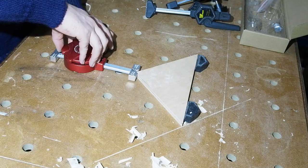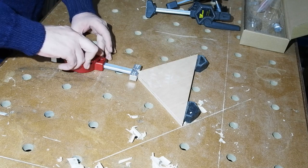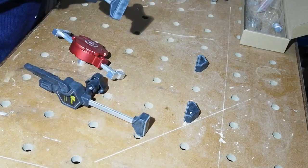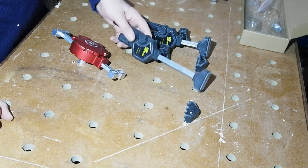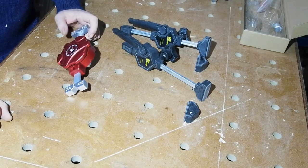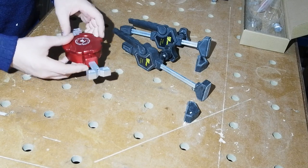The Hongdui clamp could be vastly improved by drilling and tapping the aluminium dog for an M6 or M8 male star knob you can screw in underneath. This is such a huge oversight for Hongdui - it's a piece of cake to fix but it should have come with a fixing-down option. No arguing that it's a beautifully made piece of kit, and I'm sure it would last a lifetime. It's on offer at the moment for 42 pounds, with a recommended retail price of over 60 pounds - and that's just for the clamp, no stops.